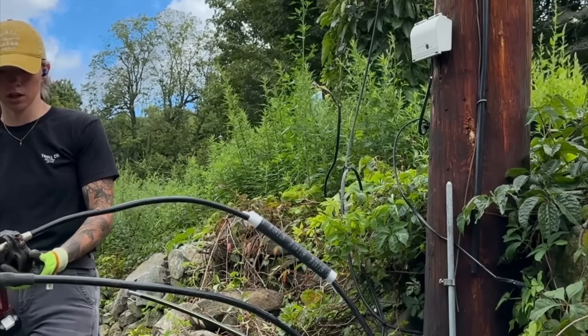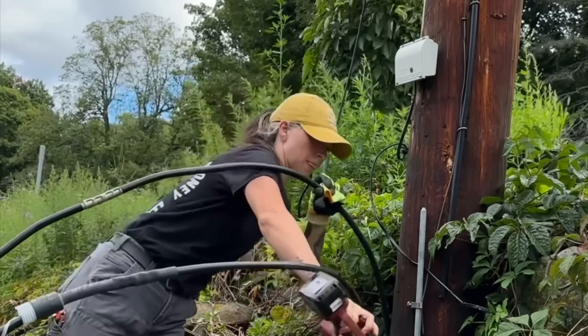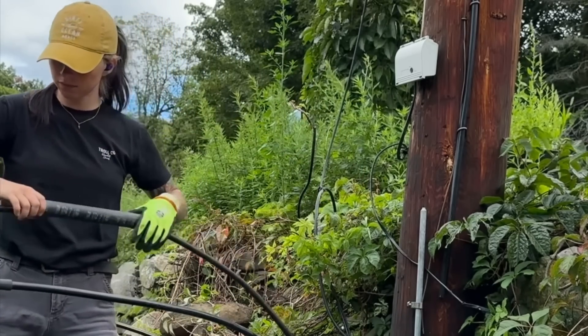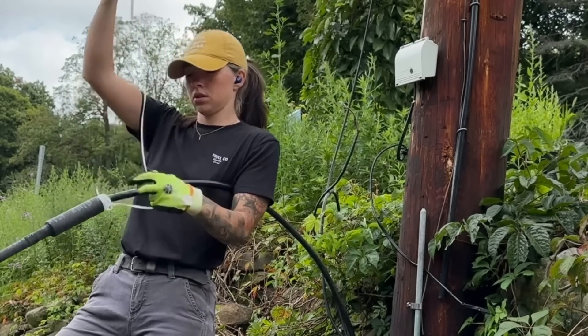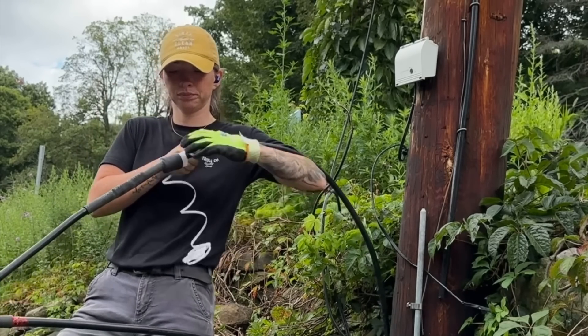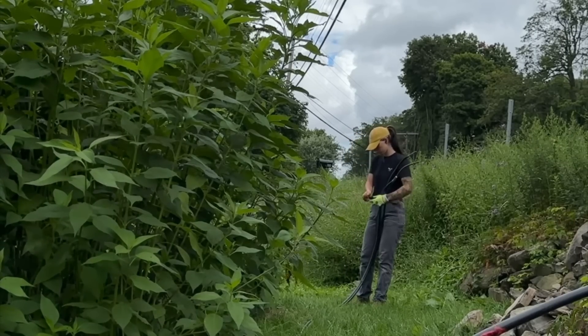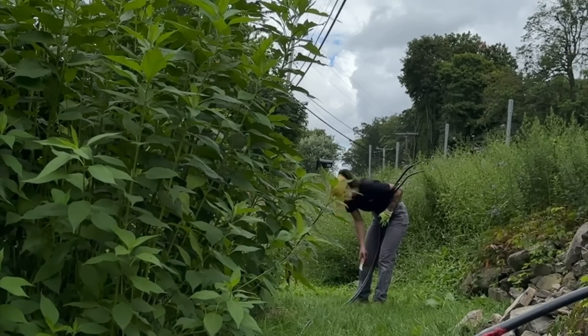I used cold shrink because I didn't have my heat gun on me at the time, which was fine because I actually like cold shrink a little better. They are a pain to manipulate, but once they're snug, they're good to go. I did that with each one of the legs, including the neutral wire, and re-put my wires back together. I had to re-spindle them together because otherwise they weren't going to go through the pipe nicely and would have nicked even more.